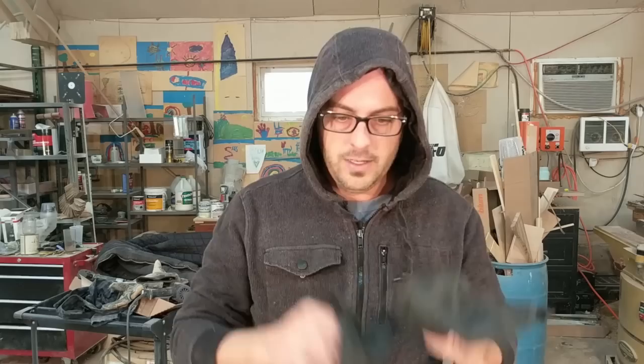The idea is you're going to want to use stain and fill in all the deeper areas with the dark stain. Something way darker than the final look that you're going for, just to give it a nice, deep 3D look to it. So you're gonna need one of these little brushes, foam, whatever kind of brush. Foam's probably not the best, but it's all I had, because it will react with some stains. You're gonna need some dark stain, some gloves, and a rag. So let's get started.